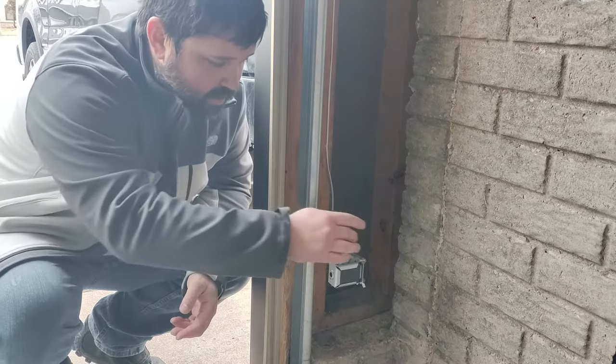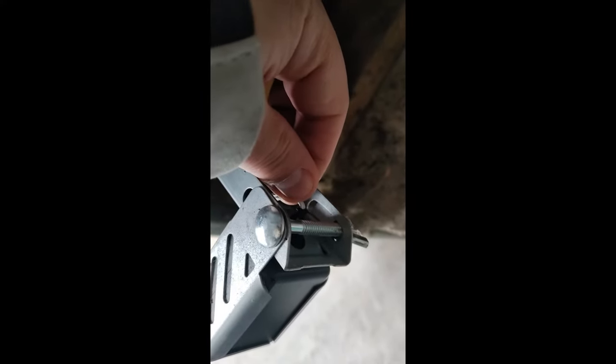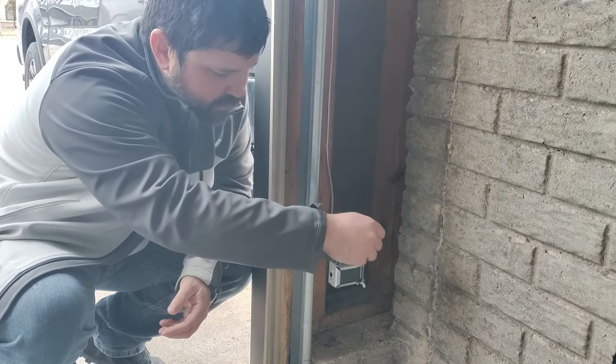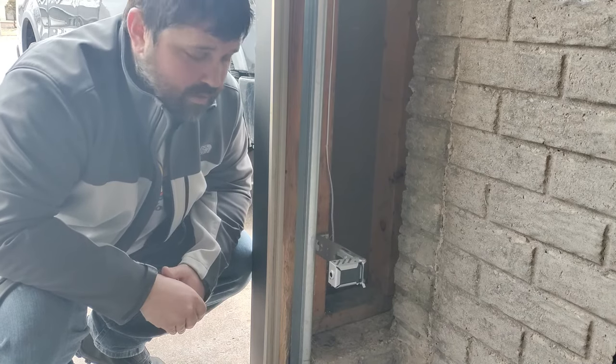The other thing to check is the wiring on the back of the sensor. The wiring can become torn up or partially loose, and when the door closes this wire will move. Whether it's on the sending or the receiving sensor, if this wire comes loose you may get little shorts, and it'll seem like there's an obstruction or that your alignment is off — when really it's just this wire coming loose every now and again. It's not an extremely common issue, but I have seen it a couple of times, so it's worth checking. Also check your wiring close by the sensors; a staple that's too tight could be causing problems there as well.